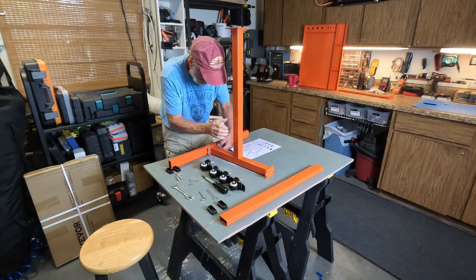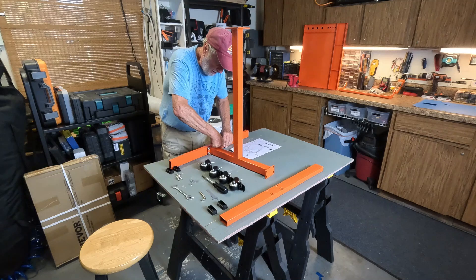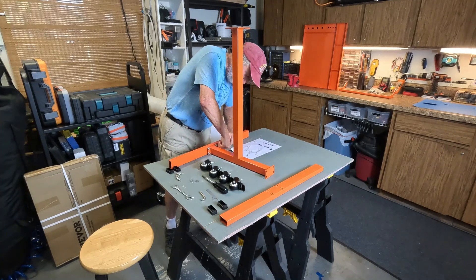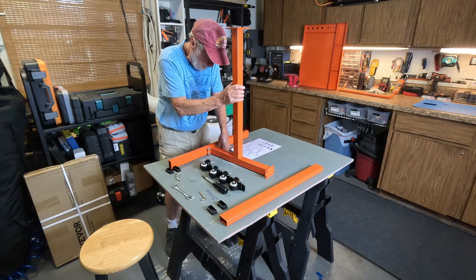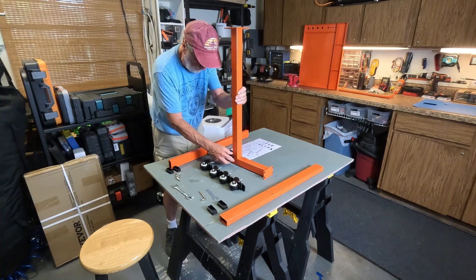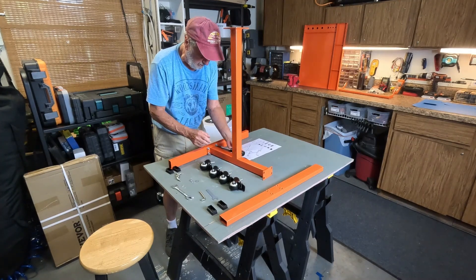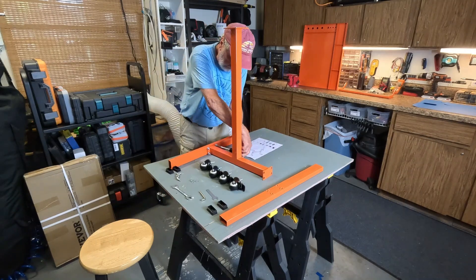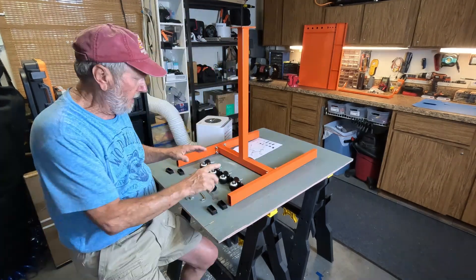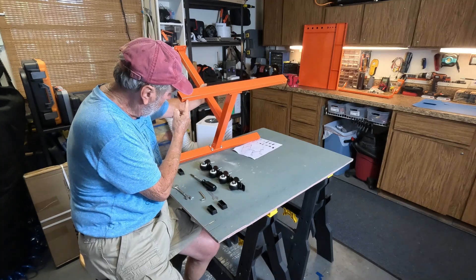I think you'll see it shouldn't be a problem. Once you get a couple of threads, it's good. Then the fourth one — tighten them up. I'm just going to snug this one, and that would be the same going all the way around. Snug them up, not completely tight, until you go through and do all of them. When you put these on — and I should have told you — on the bottom are the nuts that are welded in, so you want those facing down. It would be obvious if the nuts were facing up that you can't mount the casters.